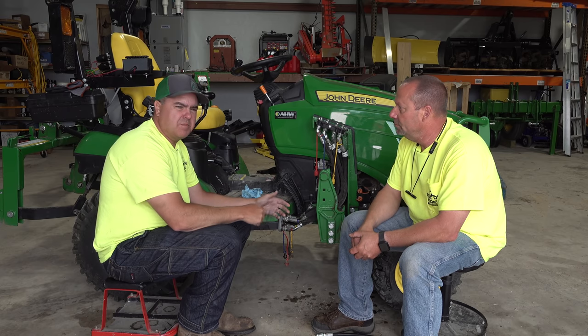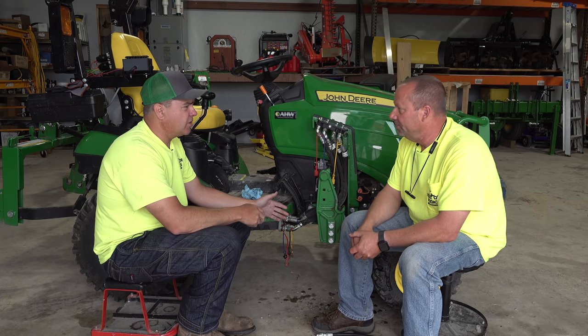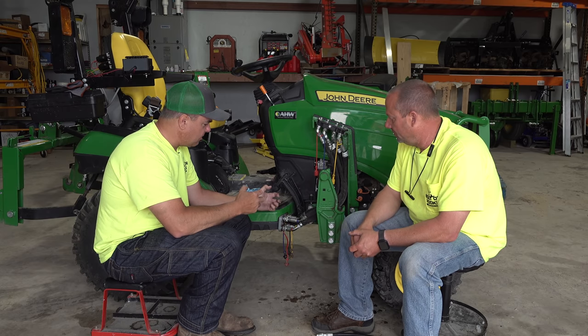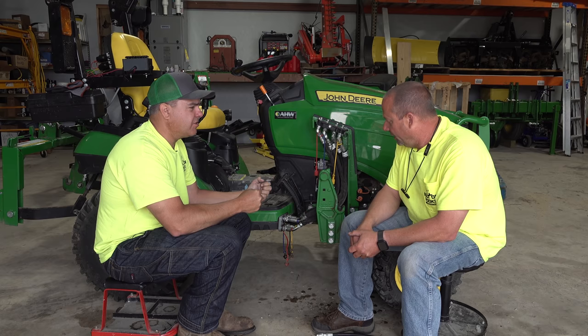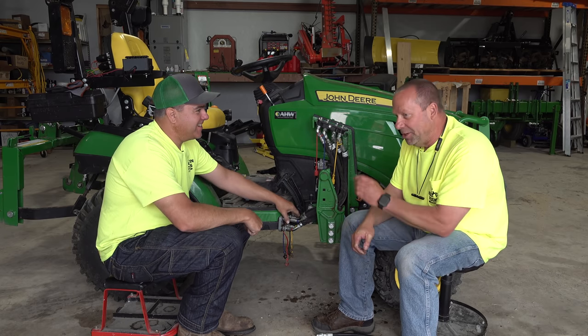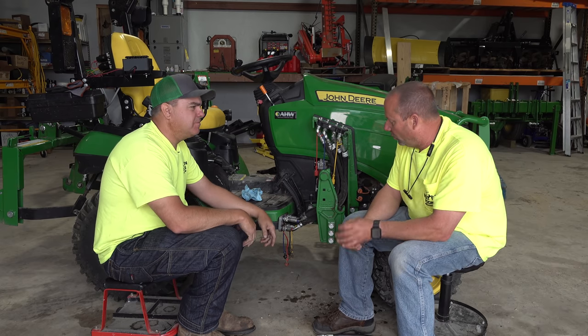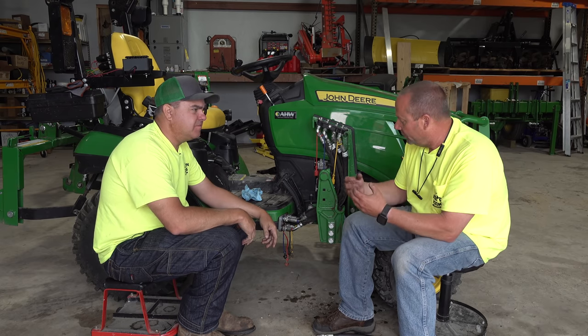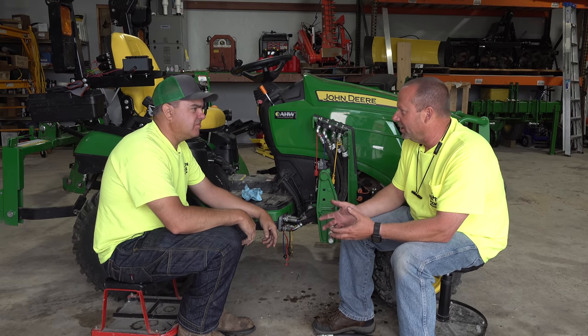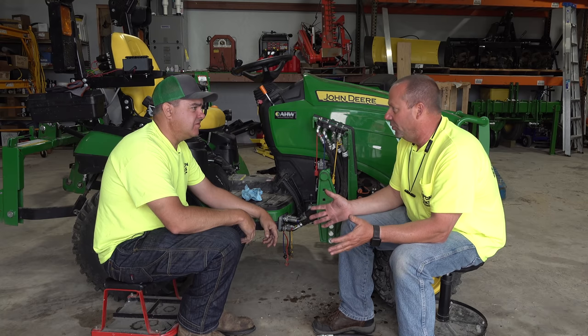Another question that we get, Ken, and a concern our viewers have, is when they disconnect these or when they connect them up, they'll get oil. There'll be oil spewing out on the floor. Is this a problem? They're just concerned about it. I mean, you feel like you're seeing blood. Yes, exactly. A little bit looks like a lot. It's normal with ISO couplers to spill what seems like a lot of fluid when you change them out. And unfortunately, it's very normal.